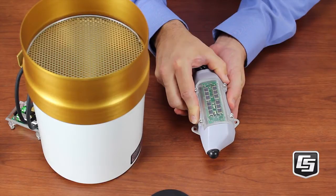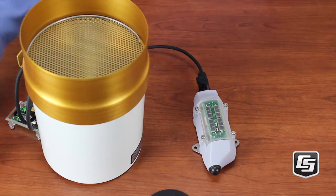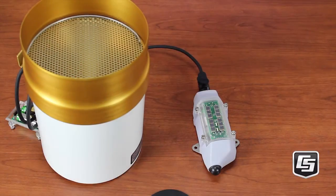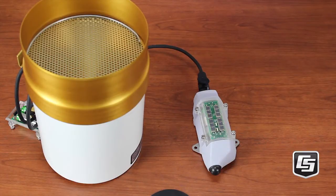Let's see if our sensor has discovered the base yet. Not yet. See how the blue LED flashes about once per second and the red LED is not lit? That indicates it is still searching for the base. I had to press and hold the setup button to initiate auto-discovery. Okay, there it goes. Once the radio link is established, the sensor flashes its red LED and transmits its table definitions to the base. From now on, the blue LED will flash when the sensor makes a measurement, then the red LED flashes when it transmits to the base. So in our example, we'll see the blue flash followed by the red flash once a minute near the top of the scan.